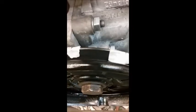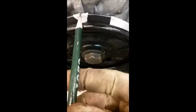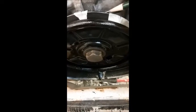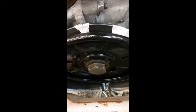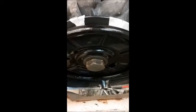Now what you do is measure the distance between this mark and this mark, and halfway between there will be your TDC. This must be one of those super beetle pulleys that doesn't have a TDC mark on it. So I'll get a tape measure and measure the distance between those two, and we'll find our true TDC.